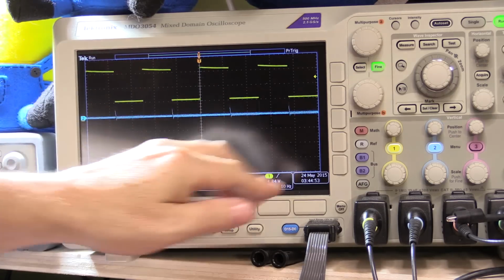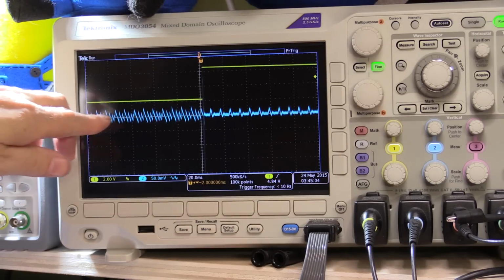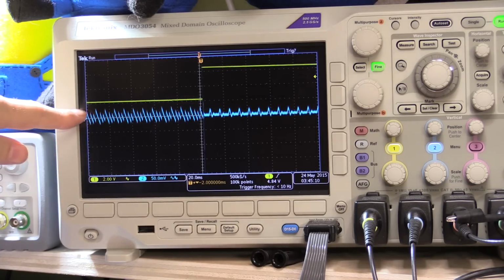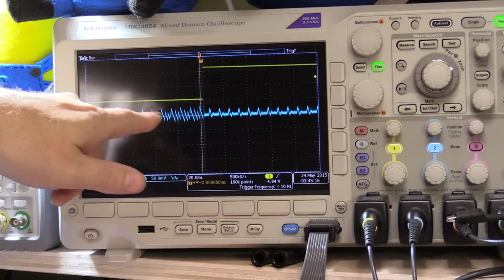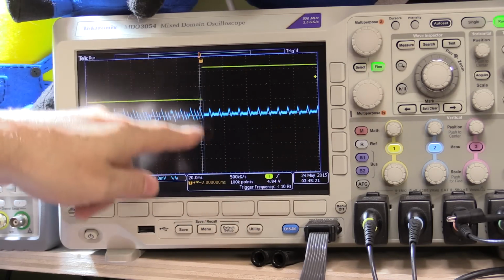See, it's difficult to tell. You can see now the integrator is jumping up and down. This is with low load, and you can see the sawtooth effect of the integrator. And then when we've got maximum load, it's still doing it all the way along, and it's not settling down, and the spikes are actually much bigger on here.